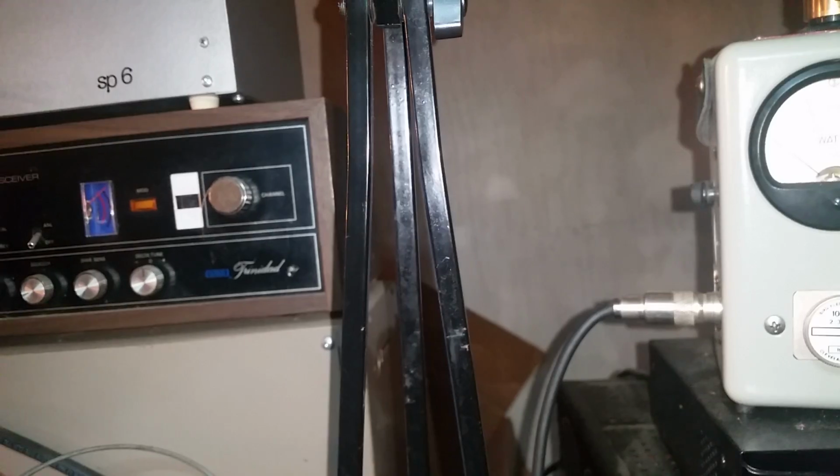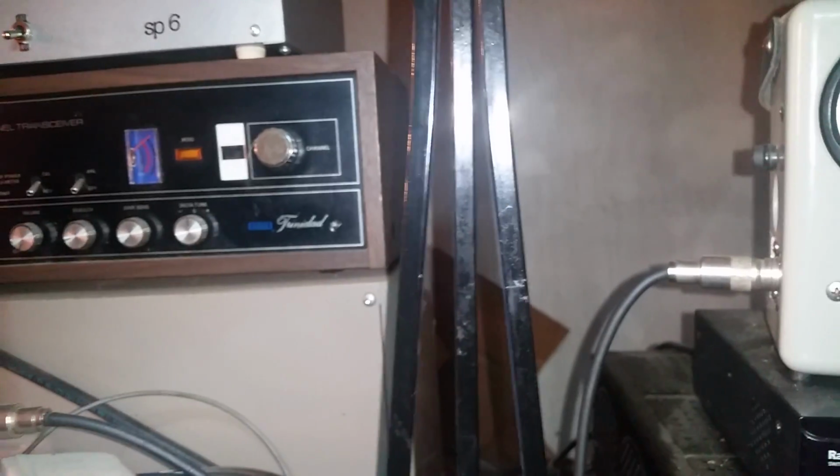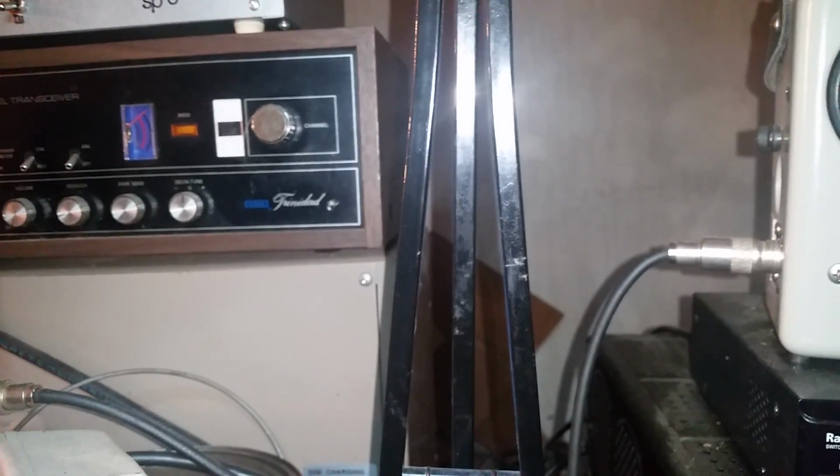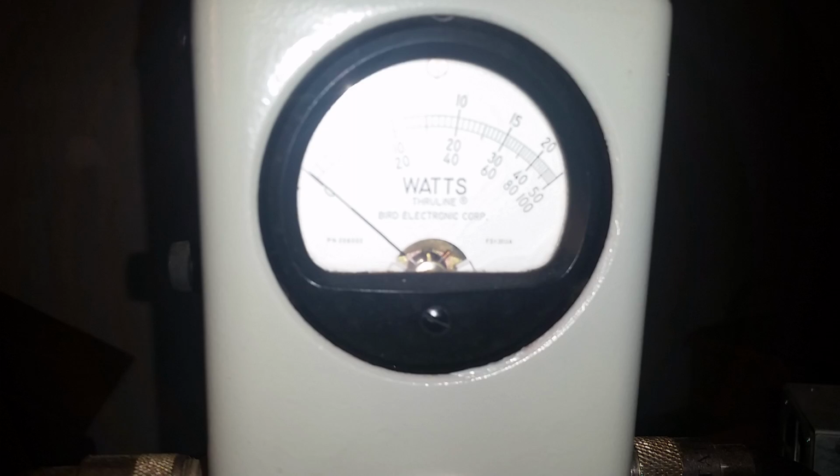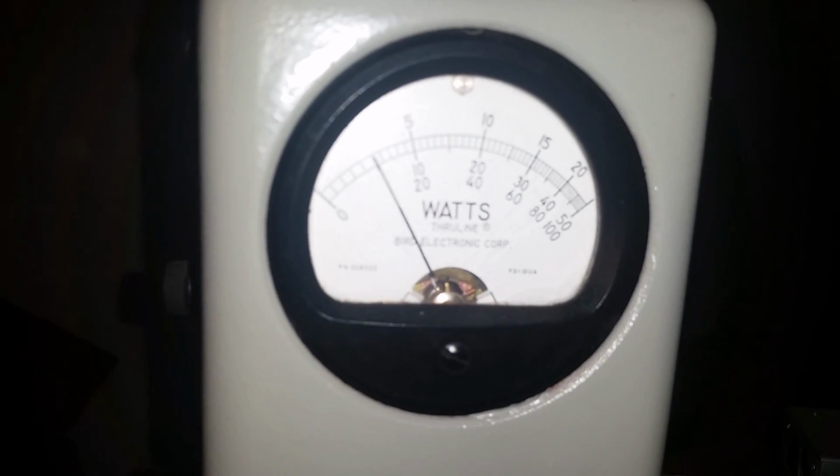All right, man. We're just going to increase to the high tap, which is where you should be running this 2x4 at. Turn that variable back just a little bit, and back up just a little bit more. A little bit more. I'm doing that with one hand, sorry about that. I think the flash is messing me up. 100 watt dead key. Right there about 350, 360 RMS.